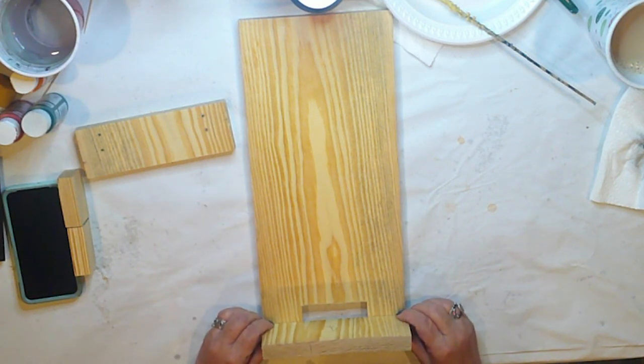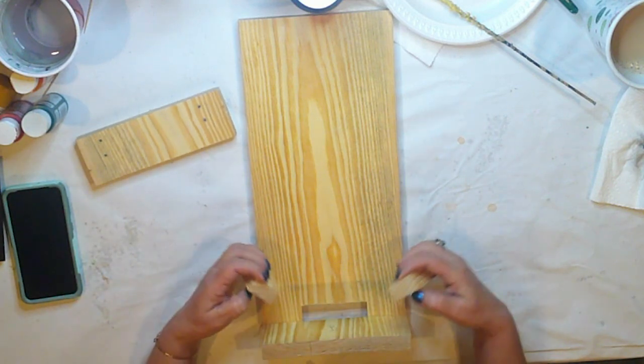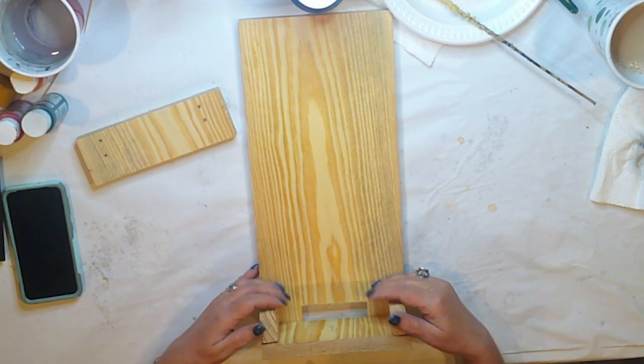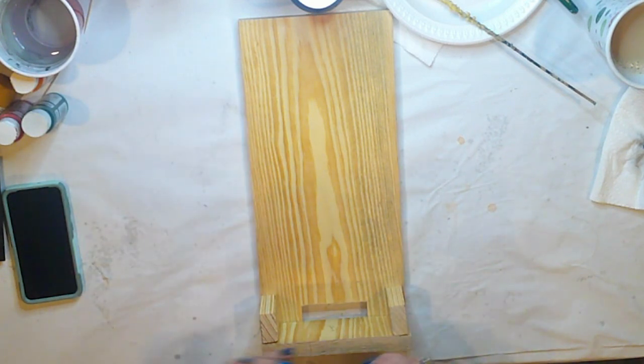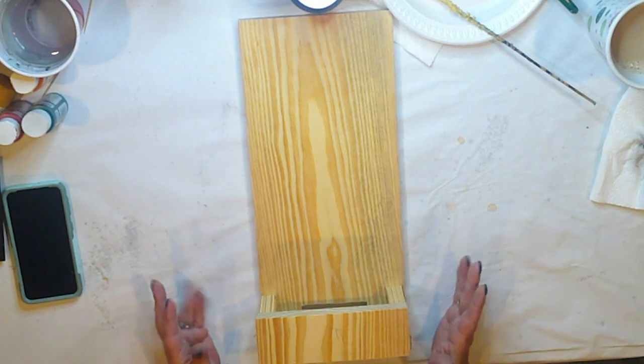For the box portion, I cut two pieces at 7½ inches wide by 2¼ high for the front and bottom of the box. I also cut two 1 by 2s to 2½ inches for the box sides. Just a very simple box. This is big enough to fit the candle base, and all the measurements will be in the description box.